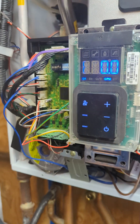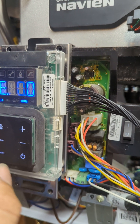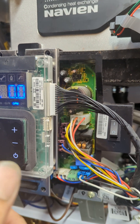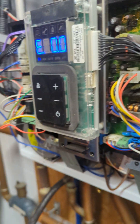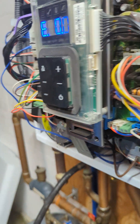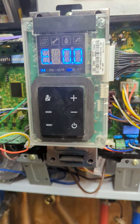It's reading 0.0 right now. For it to turn on, the minimum is 0.6 gallons per minute — could be 0.5 now, but it was 0.6. So turn on the water, start slowly, and we'll see if it kicks on.